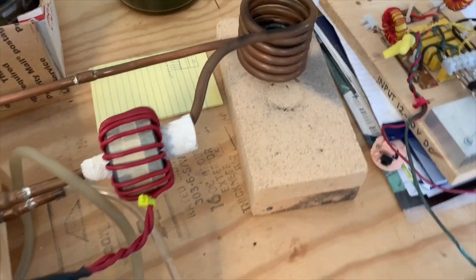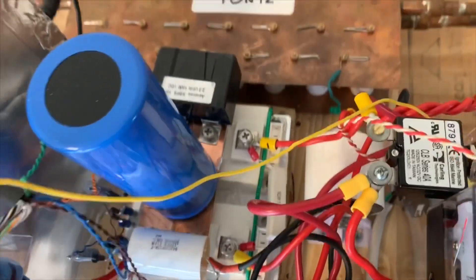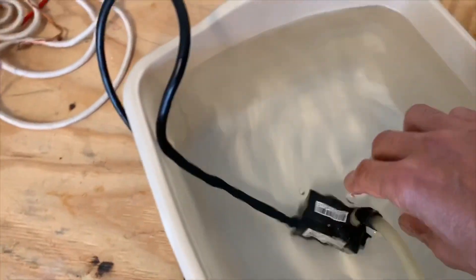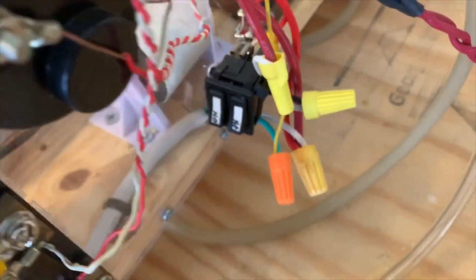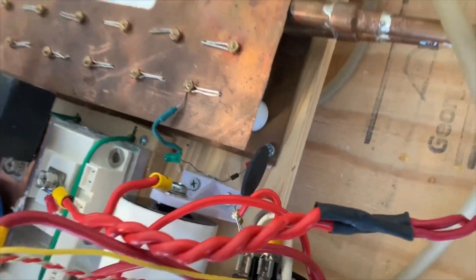Welcome back folks. Today I'm going to show you this revision of an induction heater that I made some time ago, replacing the transistors with much bigger ones — larger IGBTs. To get resonance going in this tank circuit, which resonates around 40 kilohertz, we have our silver in a graphite crucible. We're going to use water cooling for the coil and a water block to cool down the transistors. I'm going to plug this directly into the mains, using a special resistor to prevent the current surge into the smoothing capacitor.